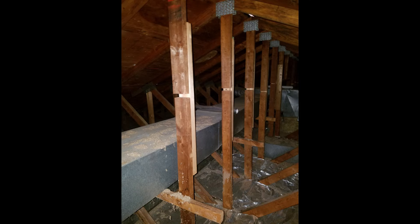Of course, there are a number of things that homeowners, DIYers, and flippers do to solve truss lift that just aren't right, and this is one of them — just one of many things that you can do that you're not supposed to do. Don't ever, ever, ever modify your trusses without having a truss drawing from an engineer.